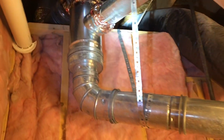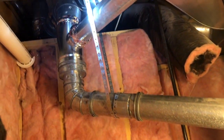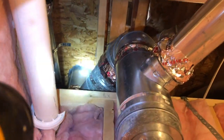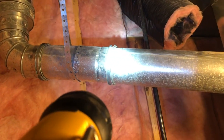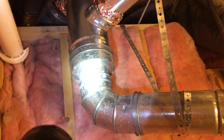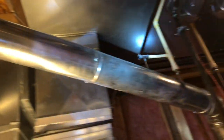This is B vent and it's dual-layered — I'll show you when we get upstairs. I was having a remodel done on my home and the B vent had to be moved from this area, you can see the hole in the floor with the two-by-fours. They make a four inch, five inch, and six inch pipe at Menards, and right here it's coming out as a four inch going down and it increases into a six inch. This is your water heater if you don't know what this is.